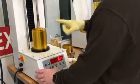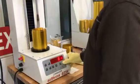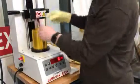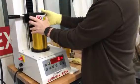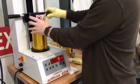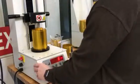Switch order to metric. This happens to be an 8mm. I have it set at 14 seconds. On this one here, because the nose of this is smaller than the hole, you see it came through — we want to bring this up to where, visually, the top of the holder is at this line there. Just turn this to hold it in place, hit our reset, and then hit start.